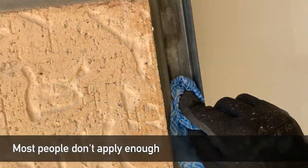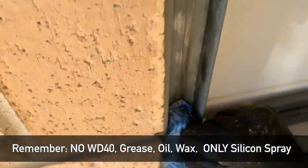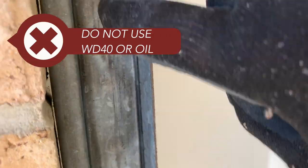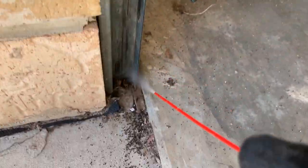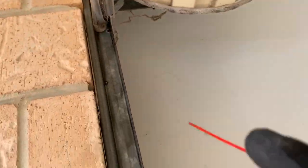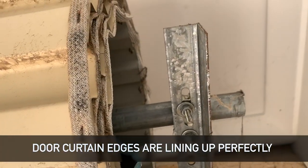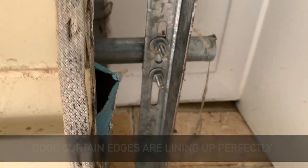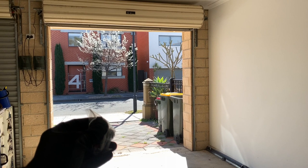The reason your door tracks will get rusted is because going up and down every day, the nylon felt also eventually wears off the galvanized coating inside the track, which you can probably see on this one. Remember, don't ever use WD-40 or anything else marketed for garage doors — this will gunk up and grease up your nylon felt edging, turn it black and sticky, and your door will not run very well at all. As you can see, this door is almost 20 years old and the fabric is almost brand new. The curtain lines up perfectly so we've got the tracks in a great position.